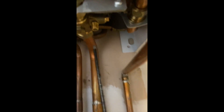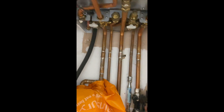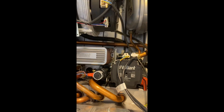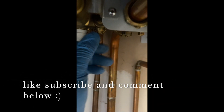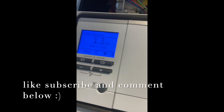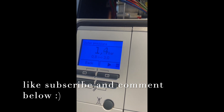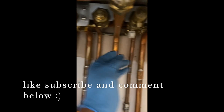Open the flow and return valves — that's the return, now open them all up. Watch the pressure and get it up to about 1.4 bar. Then close it quickly.